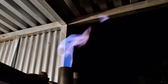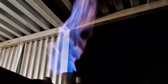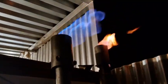This is only a 10 kilovolt power supply, maximum. If the flow increases from a certain point, the static charge is not strong enough to repel it to the secondary electrode. We have quite some more resistance now too, because it's going through the water now. Although, pretty happy with the result. If you lower the flow, it makes all the difference. Higher voltage.